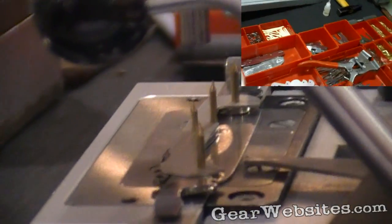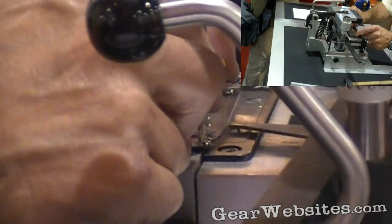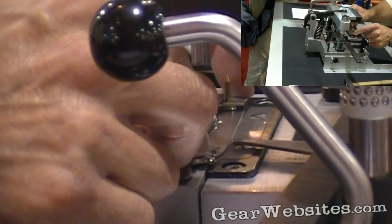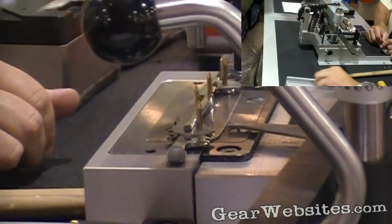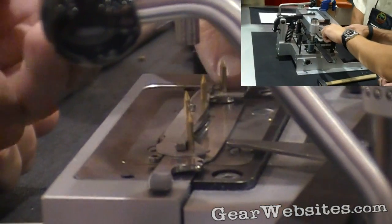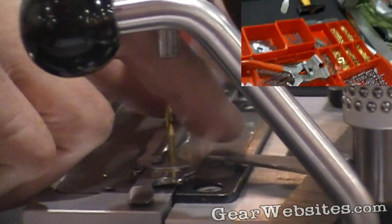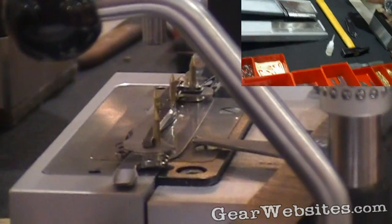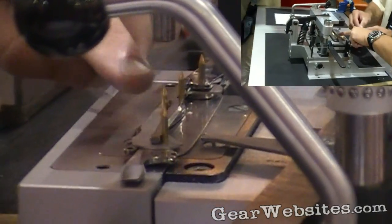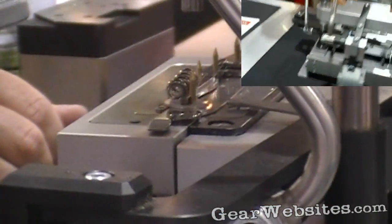The second layer starts with another back spring. Okay. So every knife has multiple layers. Every knife has back springs on those layers. Right. Alright? So then instead of the can opener, now we have a large blade. So a large blade is going to sit right there on the left. Push that flat. Perfect. We have the corkscrew. So it goes on this pin right here. Right. Tuck it in. Excellent.